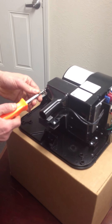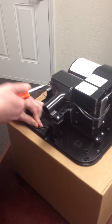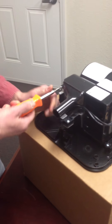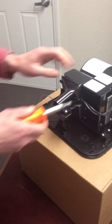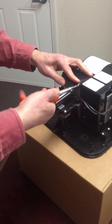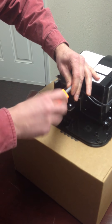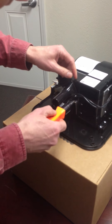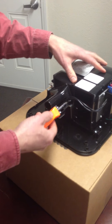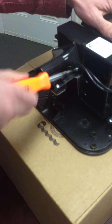This is a really easy operation. All you've got to do — which we've already loosened slightly — is pop this nozzle off. This is the standard nozzle that comes with the hand dryer. There are three screws here. I'm just using a Phillips screwdriver — very simple operation. The third one is a little trickier because it's closer to the center underneath, but it will come off.